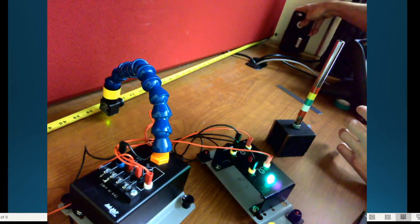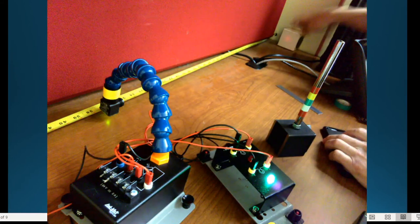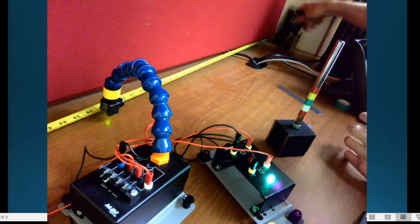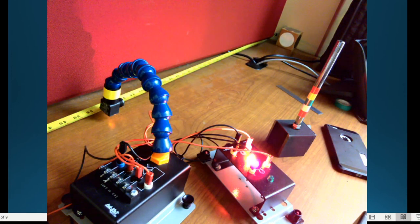So the one thing that's different here is that you actually have to have a background target, right? So if I put the white or the wood background, whatever, you're not going to be able to trigger it. You have to have this retroreflective to send the signal directly back. It's got a signal and you're trying to break it, right? So that's where it's a little bit different than the background suppressing sensor, which didn't need an end target like we do here. The fortunate thing about this is you don't have to have power on that. It's not like a garage door where you have to have a receiver down there, the 3-wire receiver with a photo sensor down there.